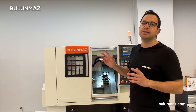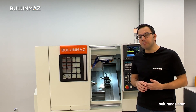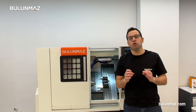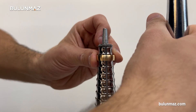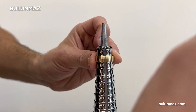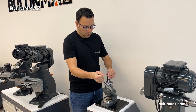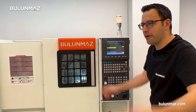For hollow ring production with your CNC machine, you just need to make it in two parts. When you make the first part, the below is empty and there is a channel on the top. Whenever you fix your rings together, you don't need any soldering. All you need to do is put these two pieces inside each other and make it fit with the ring enlarging machine, and your beautiful hollow ring is ready. Don't forget, we will make our hollow ring in two pieces, in two operations.